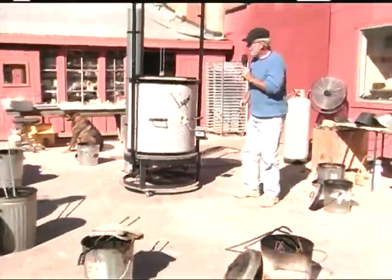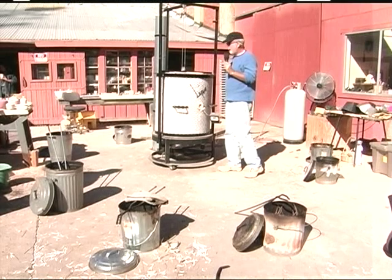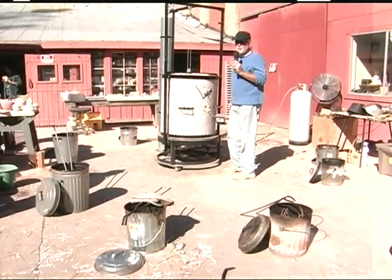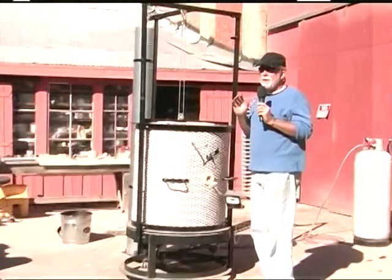Now, another way to check and see whether the pots are ready, if you don't have a digital pyrometer, is you can do a visual inspection of the pots. In looking in at the pots on the top shelf, I can see that the glazes are somewhat bubbled, which means that they're still immature, they're still heating. When they get up to about 1800 degrees, they will turn bright orange and smooth over. When we see that, we know that they're getting very close.